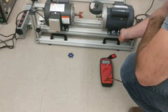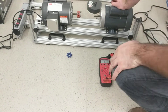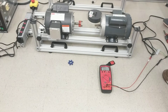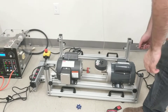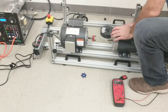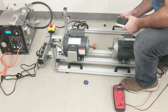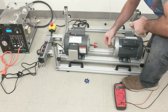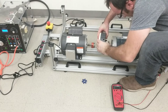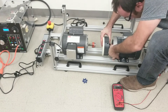What I'm going to do is have you plug that in now. Do you remember Michael said he works with agitators? We're going to simulate Michael falling into the tank. We're going to simulate Mike's arm getting caught in the agitator. This is a very heavy race. When we turn this on, what do we expect the current to do? It should go up. The current was six amps before. Pay attention because I'm giving you some homework on this.